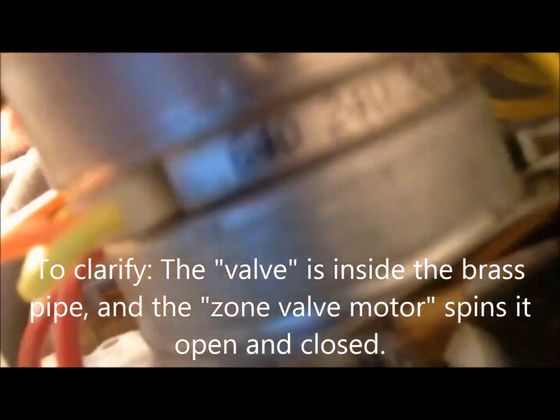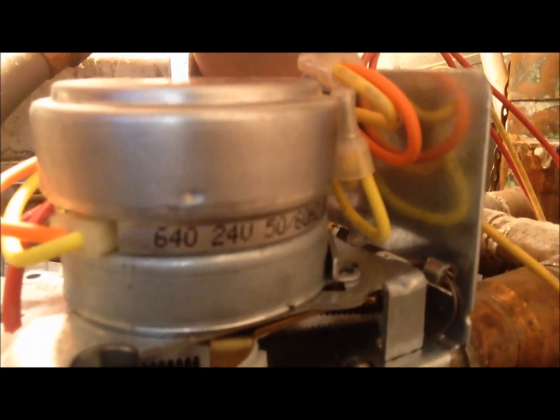I'm using that reverse iPhone camera angle to allow myself to screw in the nut on the rear. What I found was that the unit didn't bed in properly to the pipe because the valve was switched off and the new zone valve is set to open, so the two didn't line up. I had to fiddle with the zone valve and twist it around to get it to fit on top of the valve. There was a little spindle projecting up from the pipe. I fit the zone valve on top of the spindle, then rotated the zone valve around to get it lined up parallel to the pipe, and then I was able to screw it in.